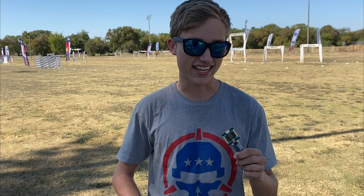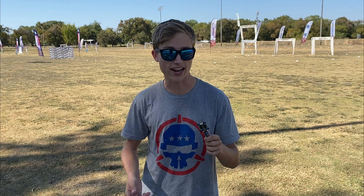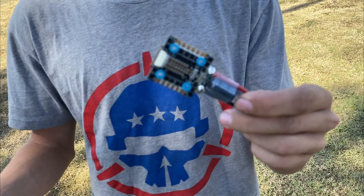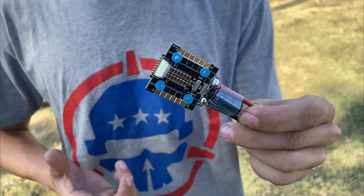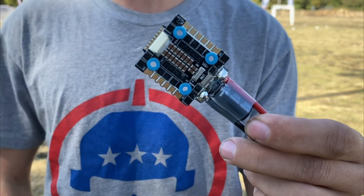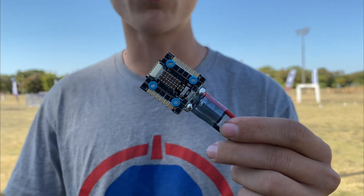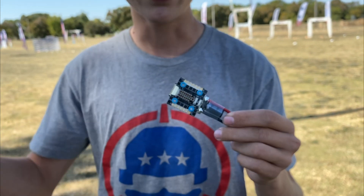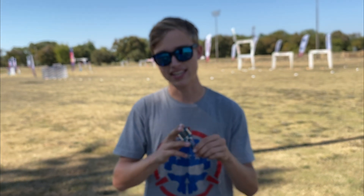What I really like about this ESC is its reliability. Most 20x20 ESCs fail in almost any crash — sometimes they even die mid-air, they blow smoke when you plug them in. We did a few things with the Hobbywing ESC here to make sure it was super reliable. First off, we went ahead and pre-installed the capacitor on there for you guys, that way you don't have to guess on which capacitors are right, or potentially damage your ESC when soldering it on. We took that step away, so now it's just pre-installed, ready to go, and it works like a charm. It's the perfect size for this ESC, and that is really important when you're running 6S to have a capacitor on.